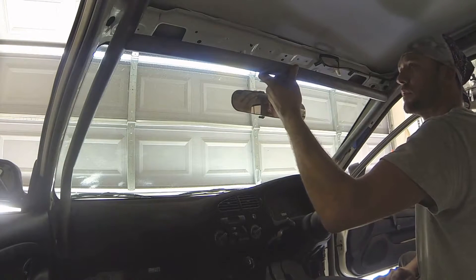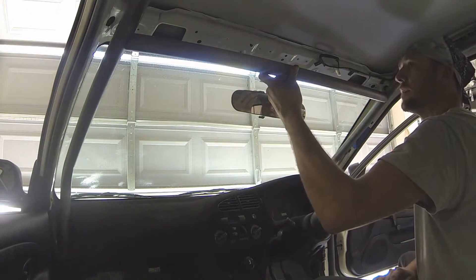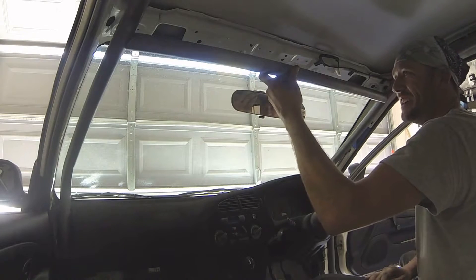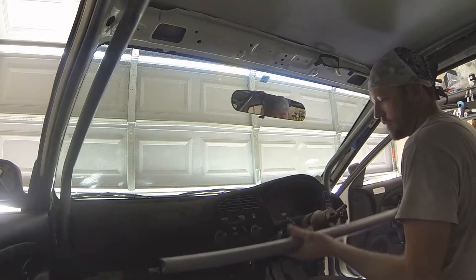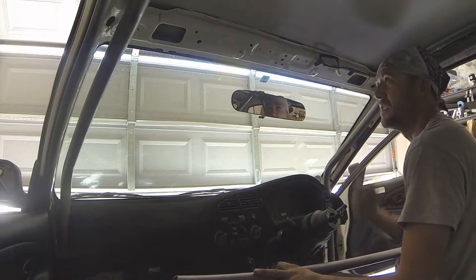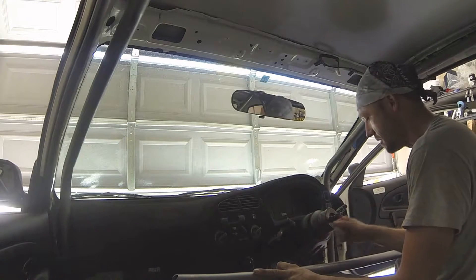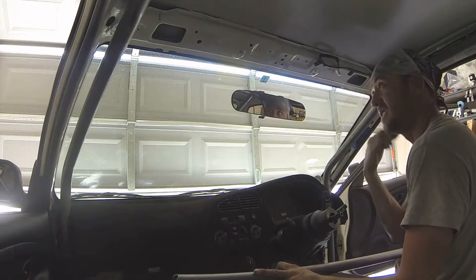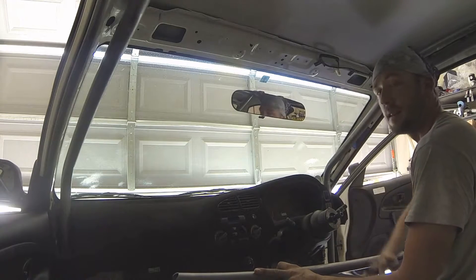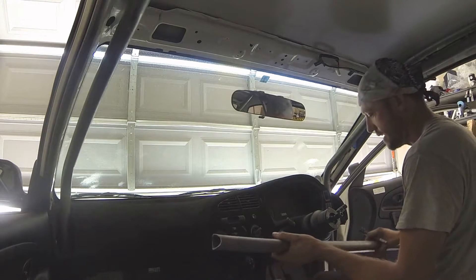I'm going to attempt to revive this tube before cutting another one. This is one of those classic examples where it starts out looking great, but sometimes in the end it just happens. I'm going to take half of this tube — a 15-degree bend is going to give me about an inch and three-eighths from my center line. So I'm going to mark out an inch and three-eighths off of that, put a 15-degree bend in here, and see how well that fits. If we can revive this tube, cool. If not, I'll toss it and start over with a fresh piece.